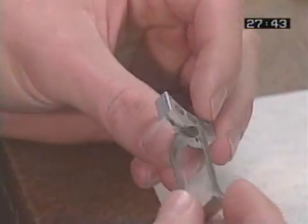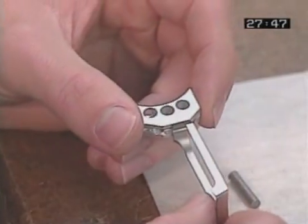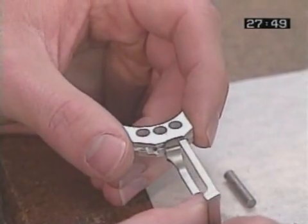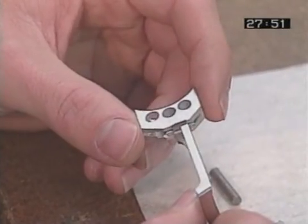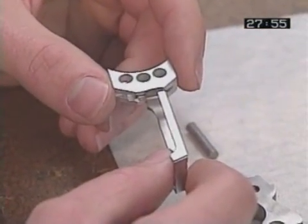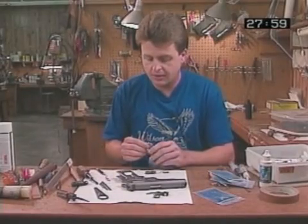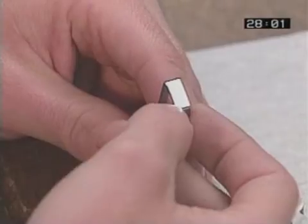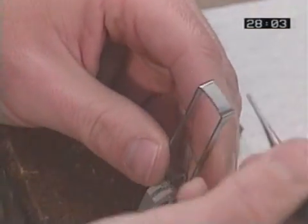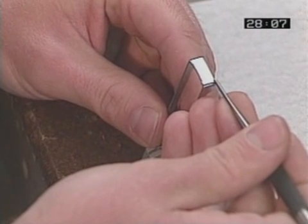And so now, what you get when you go to a light trigger like this is you don't get much of your trigger bounce that you would with a solid steel trigger, which could trip your sear and make your hammer fall when you're dropping the slide. Okay, the only thing it needs is a small flat cut on the back surface here, from basically here down.